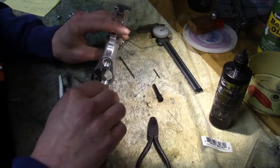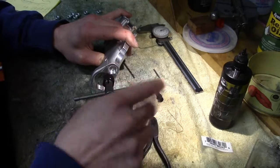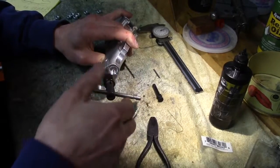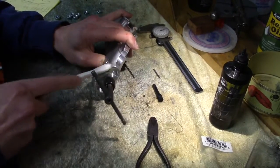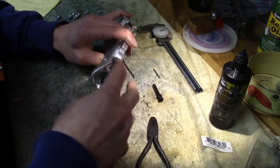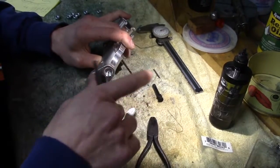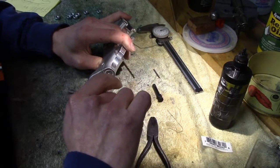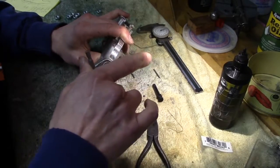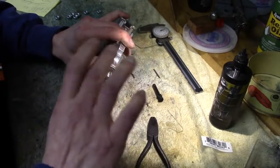This wouldn't be as big a deal if we had the right size hole, but drilling this is a real pain if you don't have a mill. Back in, then out, clear the chips, and back in, then back out. You're just going to do that probably about another full turn's worth. So we're back to cutting — go a quarter, and out, then a quarter, and then out.